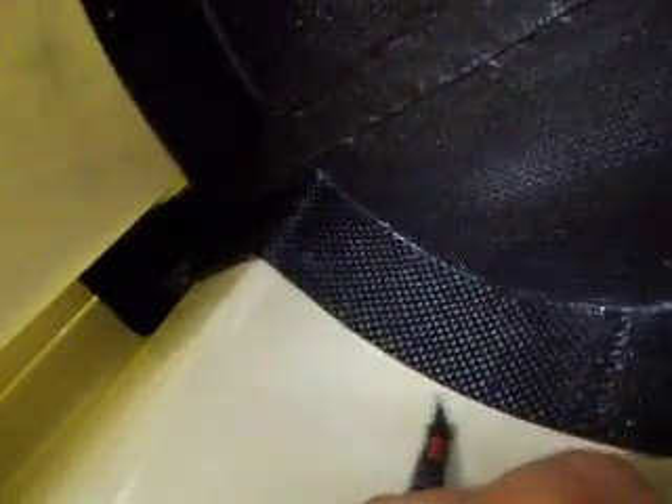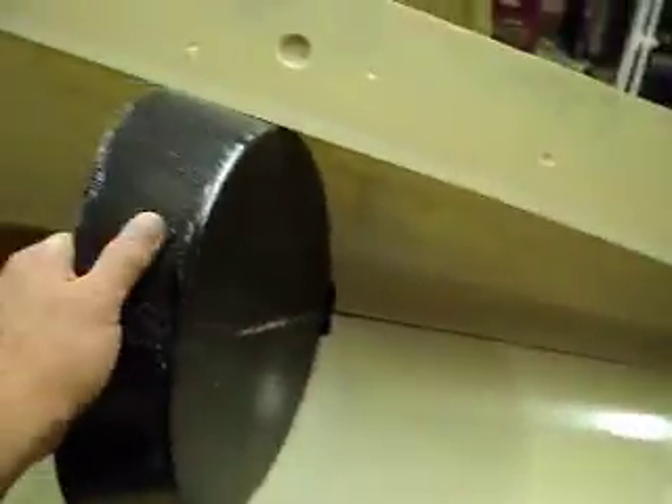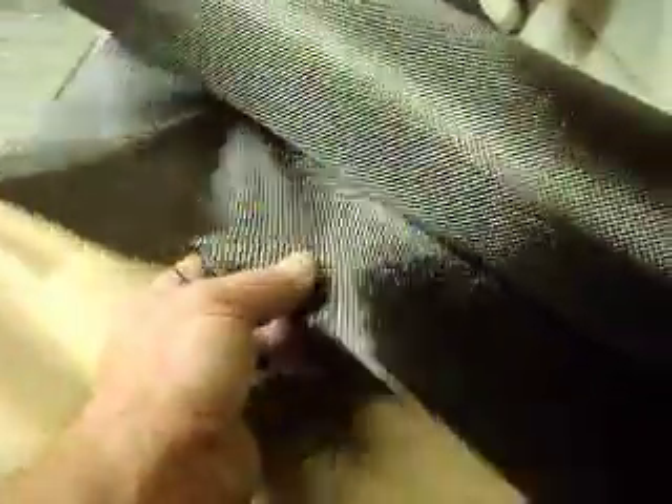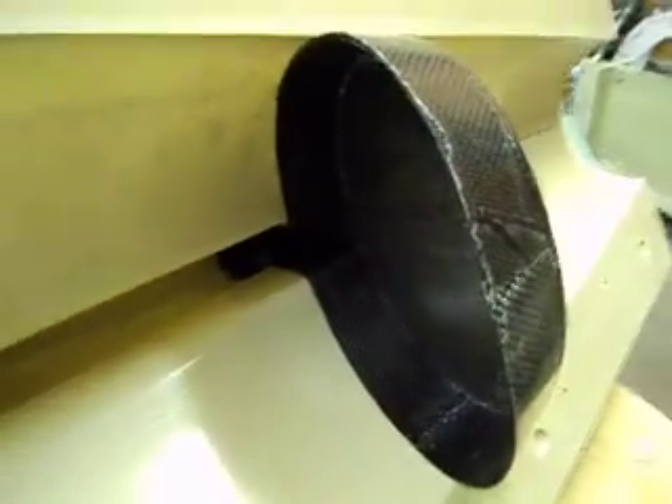All the way around is perfect. When I lay this up, see right here — in between them two — it's perfect. When I lay my glass on there, that'll all fit nice and snug. We want to thank Butch for that. That's going to work out awesome. We're going to vacuum bag carbon fiber — two layers of carbon and a layer of fiberglass. When I laminate that all together and sand this edge real good, when we glue this all together, that is going to be one hunk of carbon that will not twist, won't flex.